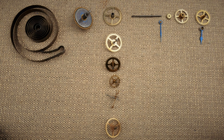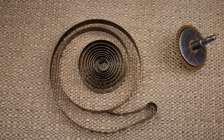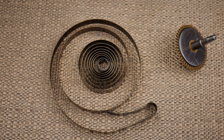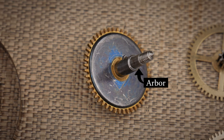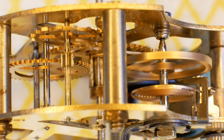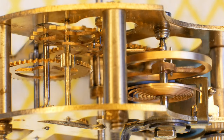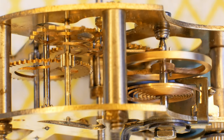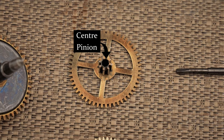This is the basic layout of the clock and we're going to break things down step by step. We start off with the powerhouse of the clock: the mainspring. When wound, a spring stores energy and releases it as torque, a turning force. This one is knackered — it should have way more bowing in it, so it's going to end up getting replaced in the future. The spring is attached to this spindle called an arbor. At this end of the arbor you can see the threading for winding the key, and on the other end we can see all of the parts that make up the ratchet mechanism. This allows you to wind up the spring. That mechanism then drives the great wheel. When talking about clocks, if a gear has more than 20 teeth it's generally called a wheel, and if it has less than that it's called a pinion and its teeth are then called leaves.